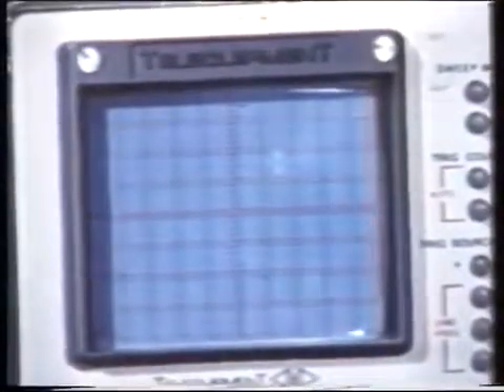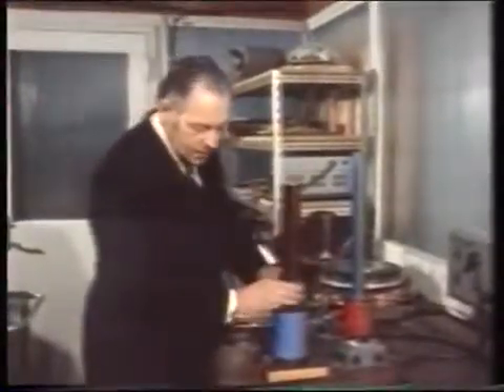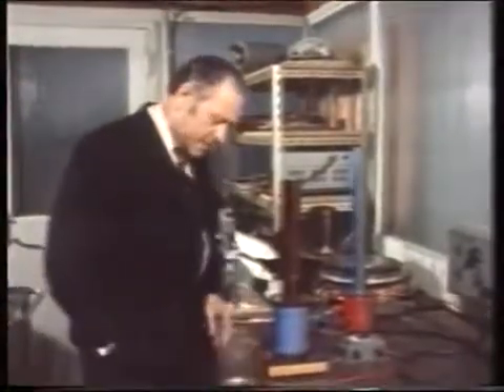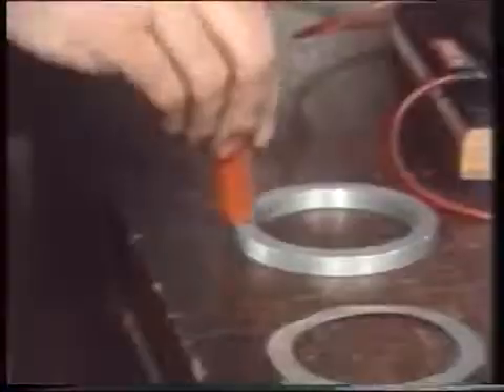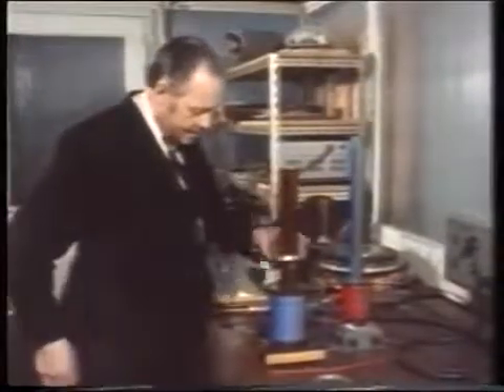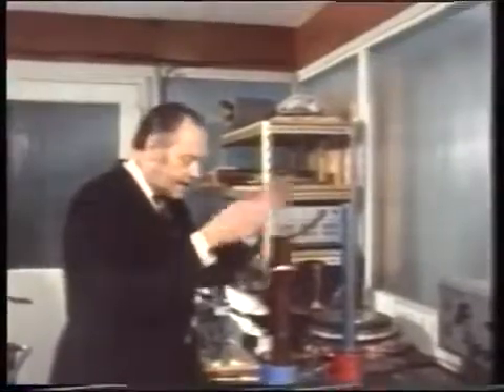Now let's have a look at an electromagnet over here that uses that kind of supply. This is a coil of wire with a long iron core. This is a ring of aluminium — aluminium is a non-magnetic substance; we can't pick it up with a bar magnet as we can, for example, a bunch of keys. So we'll put this non-magnetic ring over this iron core and switch on. You get the ring thrown high into the air. Without switching off, I put it back and it floats.